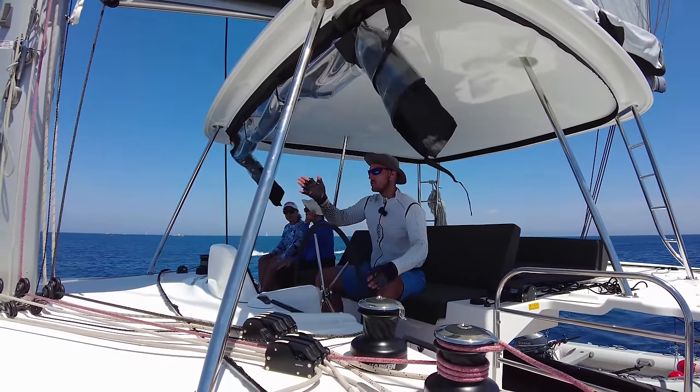Voila. So you can see here, it's good to have fenders behind. No fenders, then you probably crash the boat. And it's important to pull the mooring line as you go, because otherwise you're gonna pull the wrong end and might get in the propeller.